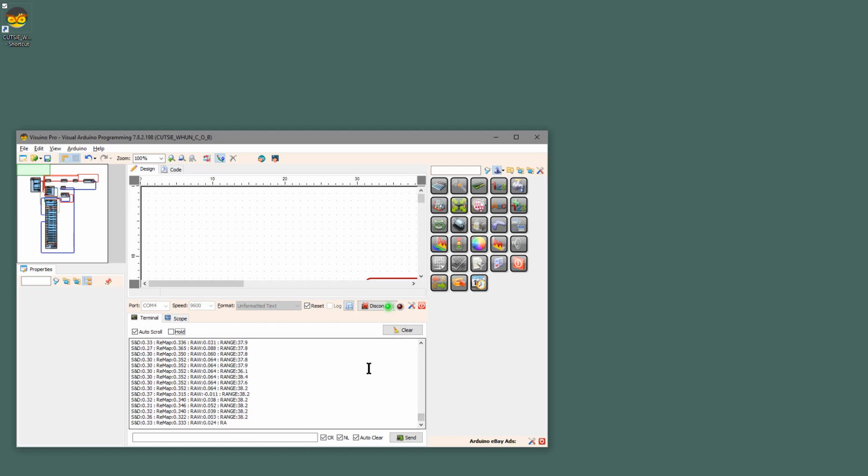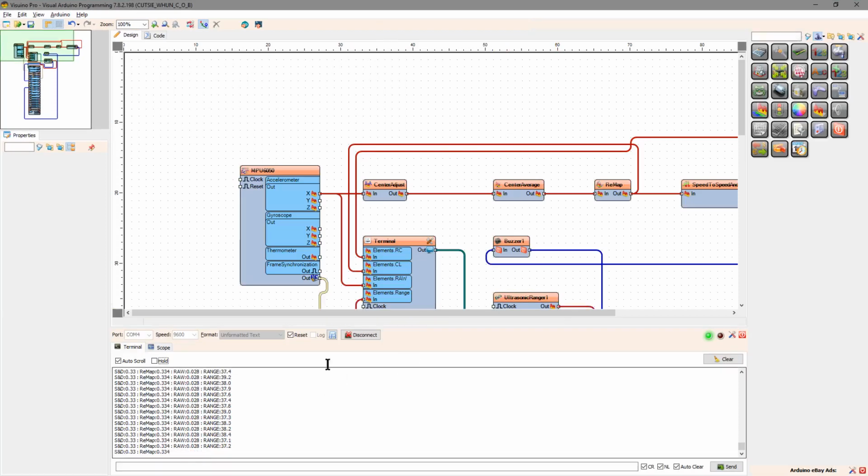Okay, now that basically worked. What we're looking at here at the bottom on these numbers is the actual data coming out of the raw feed. So if you look at the raw, it'll start beeping right when the remap hits a 5. Alright, now the raw is right there, and you want your steering in direction, your speed and direction, to be right about 0 when you're balancing.